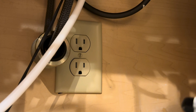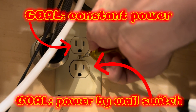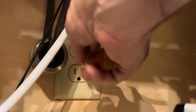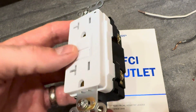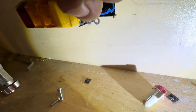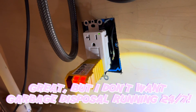My original problem: I had a standard duplex outlet underneath the sink and the top plug was where I wanted to power my reverse osmosis system, constantly providing power from that top receptacle — it always needed constant power. The bottom plug was for the garbage disposal, controlled by the wall switch behind the faucet. I did try replacing it with a GFCI, but I couldn't get that to work because it was feeding power to both receptacles — top and bottom. The switch did basically nothing at that point, which meant the garbage disposal ran nonstop. I uninstalled that and decided to move forward with the original outlet.